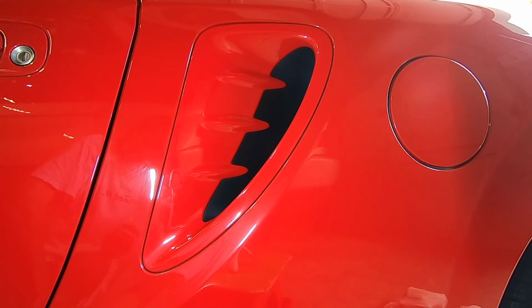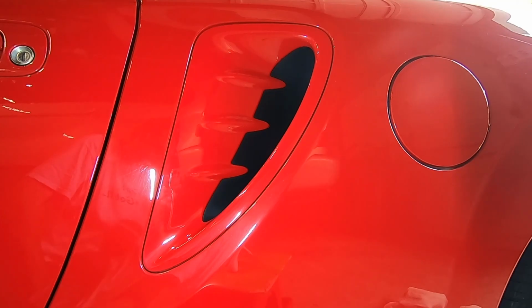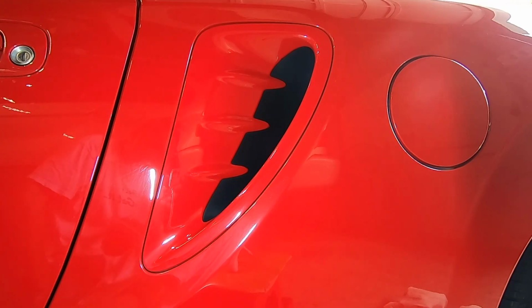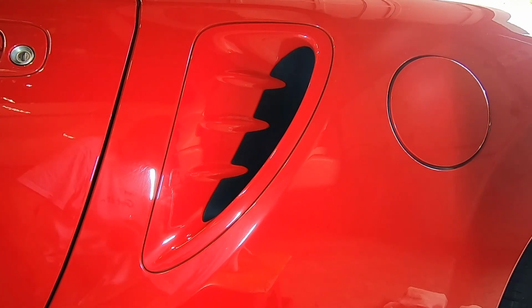The soft top drain is behind the side cover on both sides of the vehicle. The cover is held by 3 clips. Typically, to remove the cover, you may either pull on the cover or use a trim tool to pull the cover off. This is an 18-year-old vehicle, so most likely the clips will break as you remove the cover. So first I am going to attempt to clean the drain without removing the cover.